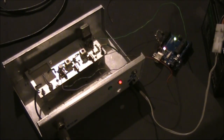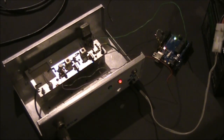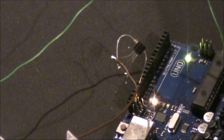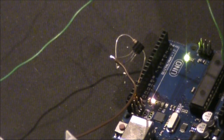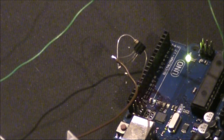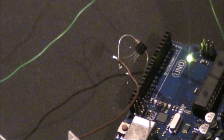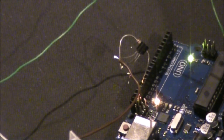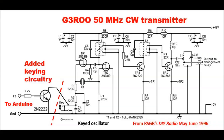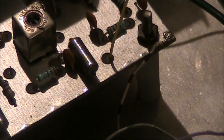On the right is an Arduino Uno that has been loaded with the sketch for a CW beacon. It transmits my call sign and grid locator. The only extra piece of hardware required is one NPN transistor — in my case a BC548 — and a 1.5K resistor. That connects between the output of the Arduino on pin 13, which is the same one that the onboard LED is connected to, and the base of the transistor.